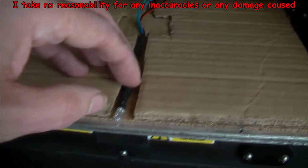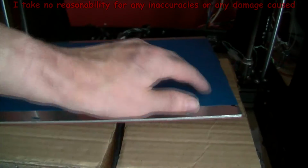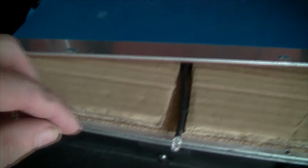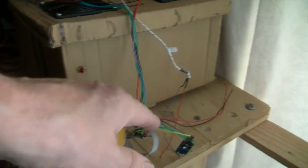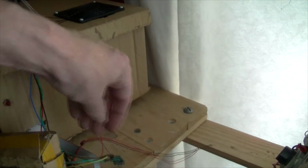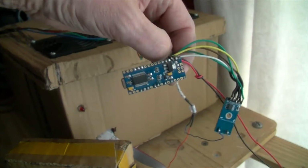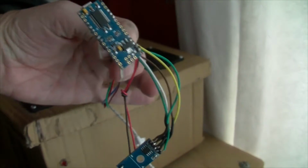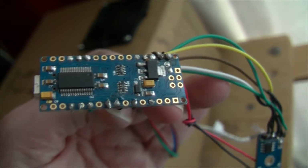Okay. So I'm going to put this heat pad back on that, keeping the wires in. This clamps on to the edges of this aluminium plate here, with these holes for now. And then I'll show you it working. So it's 12 volts going in here, input, because these nanos, the ones with the USB port on, so he's getting tangled up here. They do have a voltage regulator on, which I believe can go up to about 30 volts. I think that's that 3-pin chip there. See that 3-pin on the right hand side? I think that's a voltage reg.